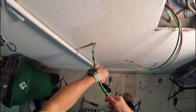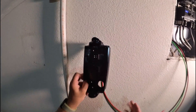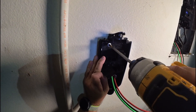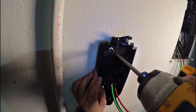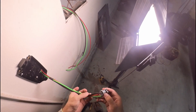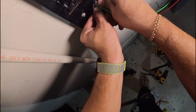This wire is secured and going nowhere — this is the wire that will be installed inside the Tesla charger. You may also use a fish rod, but I decided not to since it was a close location and I could run it directly from this spot. Now the wire is here; secure the box. Let's put the clamp here — the wire should be installed that way. On this side I'll use a push-in three-quarter clamp; just put it on and push it in.